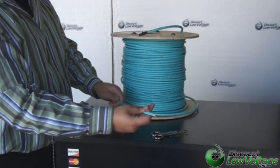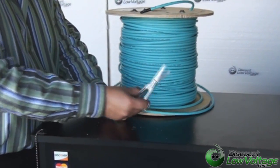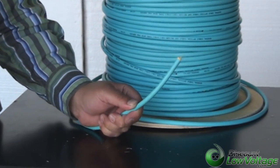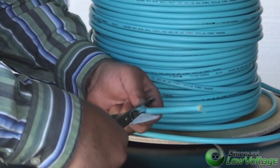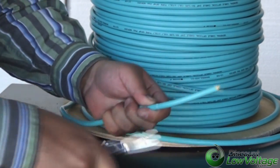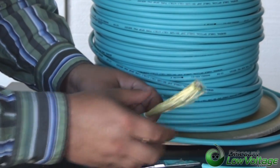This is 50 micron glass inside, and this is definitely very common for 10 gigabit applications for those Cisco Catalyst switches or those Hewlett-Packard ProCurve models that have been pretty popular lately. There's definitely been a big demand for this type of cable, this type of fiber lately.